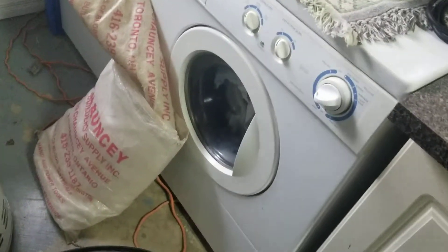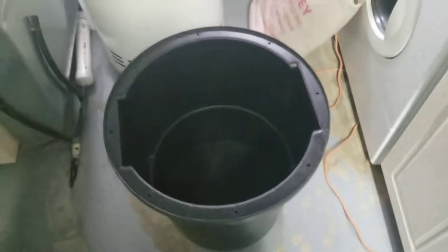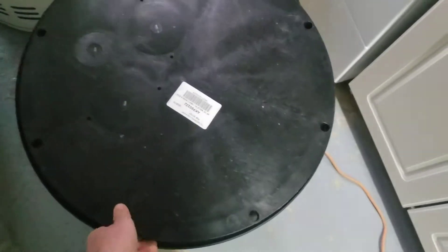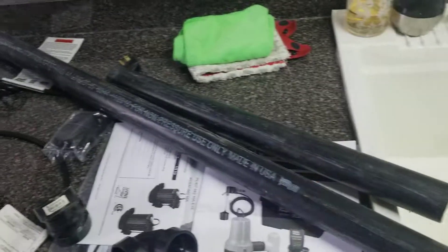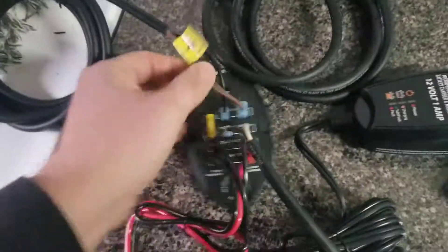This is what you need for installation of the sump pump. This is about how big a barrel we put down — it's called a sump pit — into the floor, make it flush with concrete, and use one-and-a-half inch ABS line to do the discharge line.